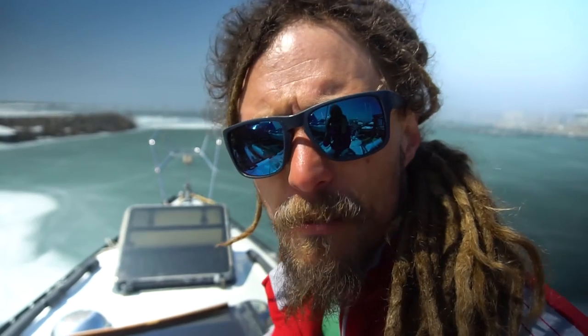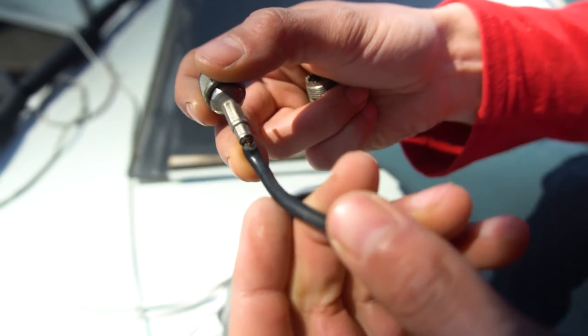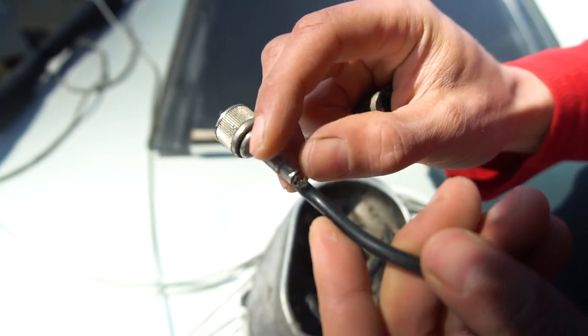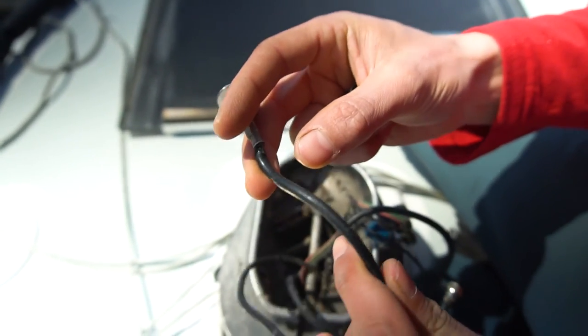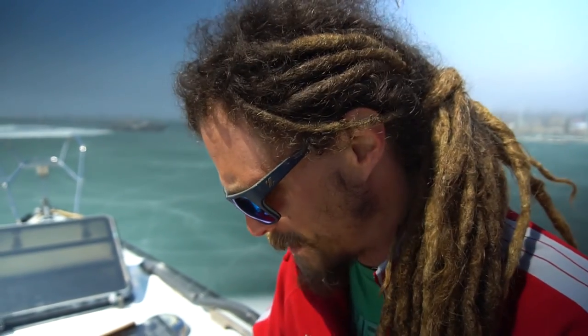We were wondering why our VHF wasn't working. The other day when we were looking at the mast, we realized a lot of the wire was quite broken off from itself, and it's also broken here. We have pretty serious corrosion and broken shielding of wires, along with what I think is the center pin that broke off. It's a very tiny center pin and a very tiny cable, so no wonder we had no radio — it was broken in many different areas. Something else that was an interesting surprise: I was sure all of our lighting on the mast was working, but the wires are basically falling out of the connector.